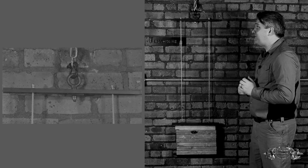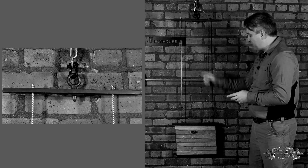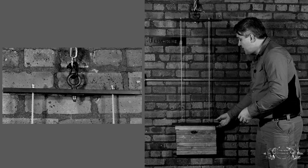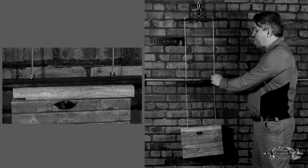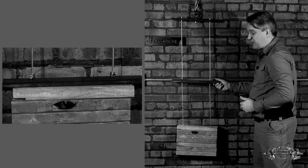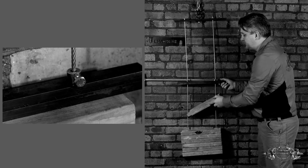To illustrate how this works, we built a mock-up arbor. So here we have our test arbor. We made it out of some small C-channel. We've got top and bottom. We've got the verticals made out of 3/16th wire rope, and then we have a top plate with thumb screws and a spreader plate, again fabricated out of some small C-channel. Then we have our counterweight made out of 2x4s.